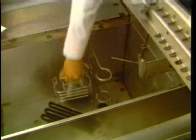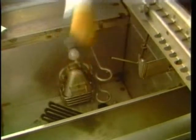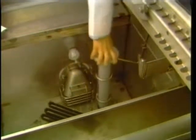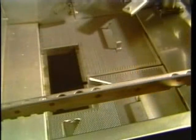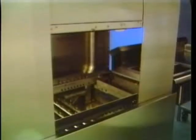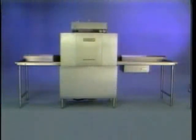Once the tank is clean, you should replace the pump intake strainer, the overflow tube, strainer pans, the strainer basket, and the final rinse pan strainer. Finally, leave the door open and the curtains removed so the inside of the Warewasher can dry. The C44A is now ready for the next working shift.